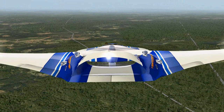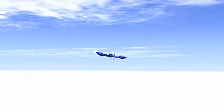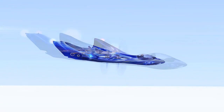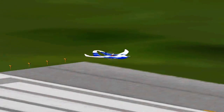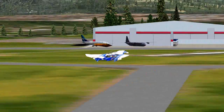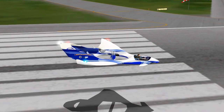This system will gradually start phasing out the more forward speed the plane picks up. At full forward flight, the artificial stability system is completely disengaged, and the pilot inputs make it directly to the control surfaces 100% of the time in the manned scale sizes. The unmanned versions retain the artificial stabilization system about the pitch axis throughout their entire speed envelope. Like the puffer system, the artificial stability system can be disengaged, allowing the pilot to get a feel for the natural behavior of this plane.